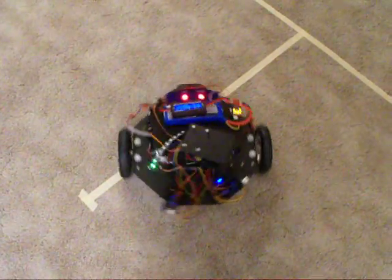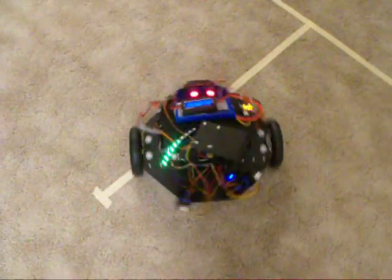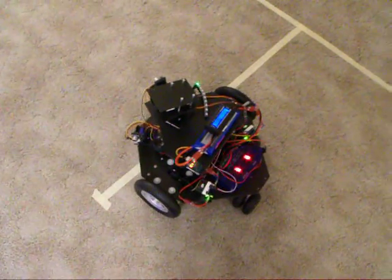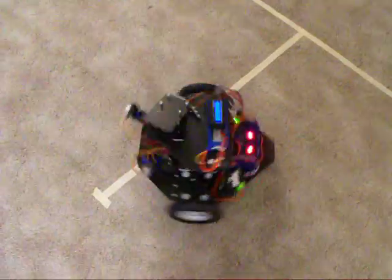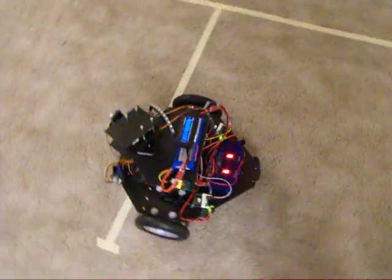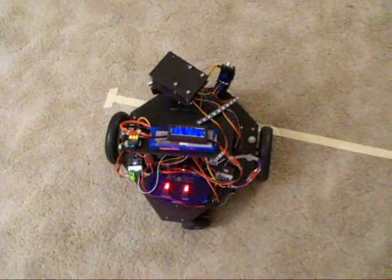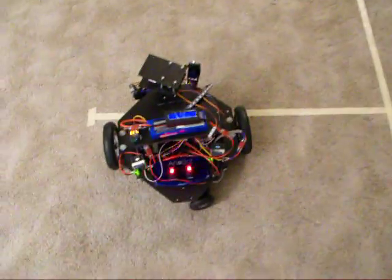If I added an integral component, as the robot traveled it would probably be helpful. The error is not noticeable if I just have it run the usual course - do a rectangle and then a couple of figure eights. There's error in the figure eight but it's because the wheels are turning at different speeds anyway.